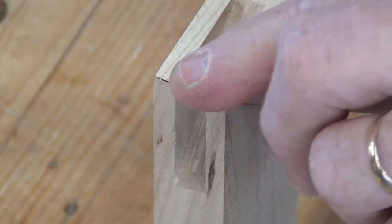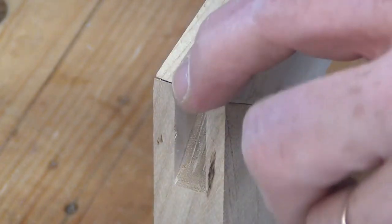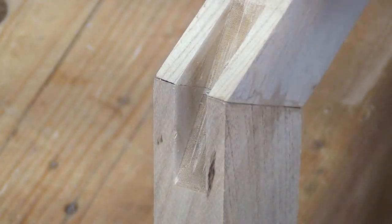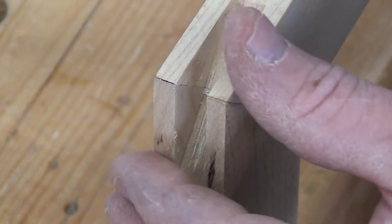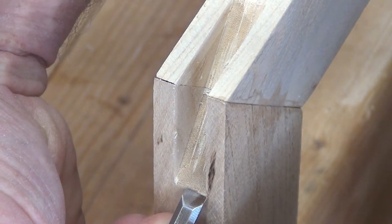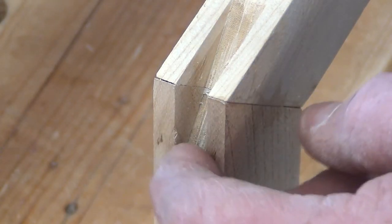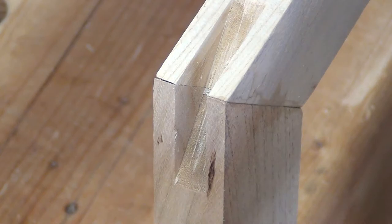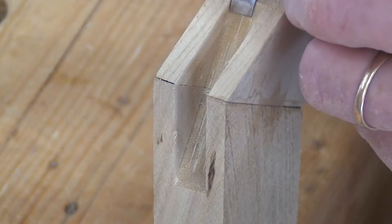So I've cut this spline joint I'm going to put in this frame now, but you want to make sure the knife wall right here, or actually right there that you can see right across here, is exactly where you want it, or when you put your spline in, it's not going to look parallel to the other surface. So we need to clean this up a little bit,